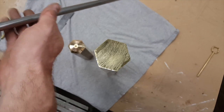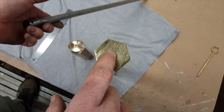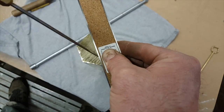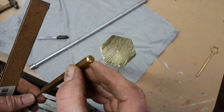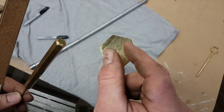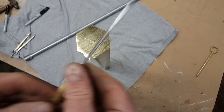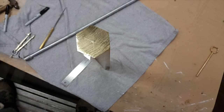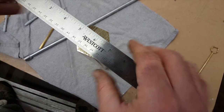I've got this half inch stock and I think this is going to work out for the spike. I need to make sure it'll fit inside this brass. I also need a center for the lathe. At the end of this thing, when it scales up, the circle portion is about an inch and a half, so I need to mark that here so I don't cut beyond an inch and a half. I need a slightly smaller circle that matches the sheath, and in this case that's going to be 7-eighths, so 7-sixteenths.